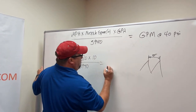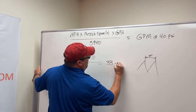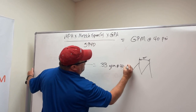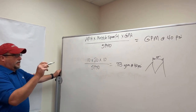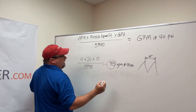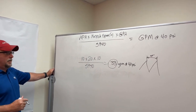So that's going to be 0.33 gallons per minute at 40 PSI. That's how everybody comes up with all the nozzle sizes. So from there, nozzles are color coded. I come up with this number and say, okay, you need a 0.33 gallon per minute at 40 PSI nozzle.